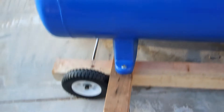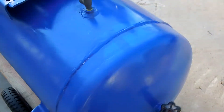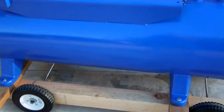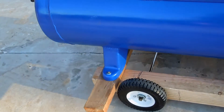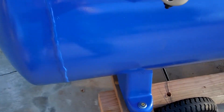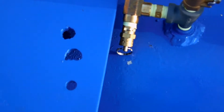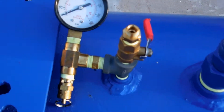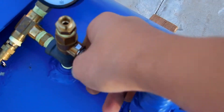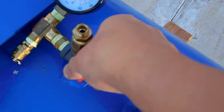I have the tank for it and I put it on this little cart. I'm not sure — this is probably like a 60 gallon, maybe 80 gallon, somewhere around there. I've got a little air filter and air regulator, and I have 250 PSI relief valves, a pressure gauge, and the blow ball valve for the continuous run setup on the back of the compressor.